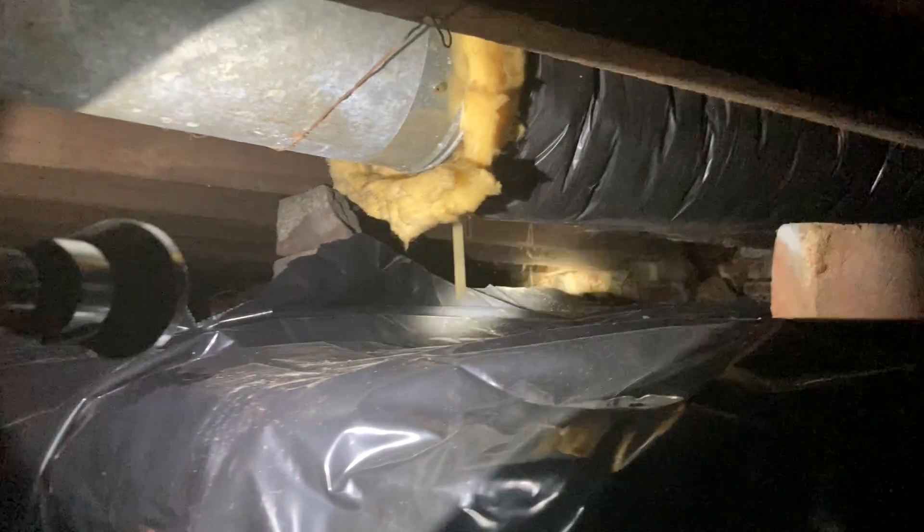So what are you looking for when the house is 100 years old? The first thing I'm looking at is the foundation. We're going to be able to see a very limited amount of it here, but the little bit I can see so far, and the crawl space opens up a little more behind us — actually, for a 100 to 120 year old brick foundation, it's not horrible. It's in surprisingly decent condition from what I can see.